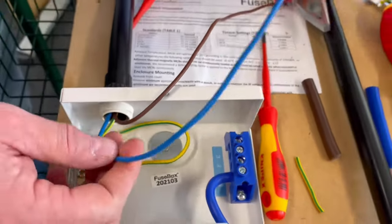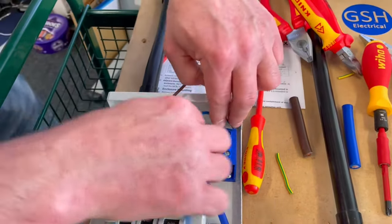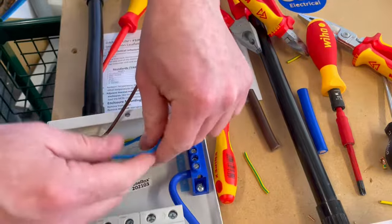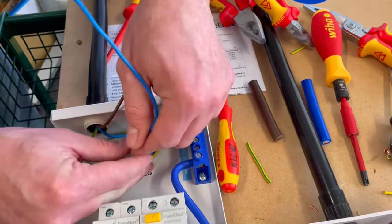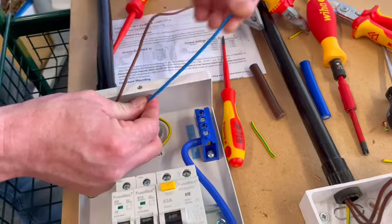Our neutral connection is going to go into number two of the neutral. So again, it's how we're going to make that look reasonably neat. We're going to bring it round like so. It is tricky in singles. I proved last time I couldn't do it brilliantly. I do want to follow something like the similar pattern. Do you want to follow something like that? But then come straight out the other end. You want to come out like that. I don't know, it's however you fancy doing it in order to get it neat.